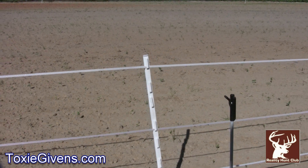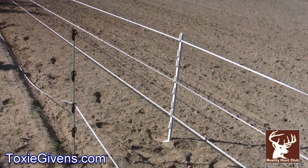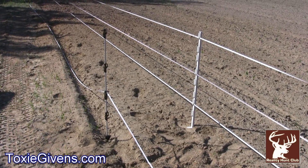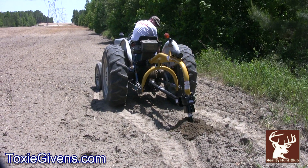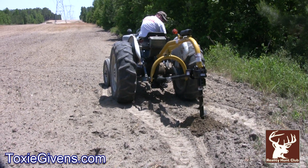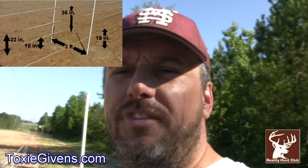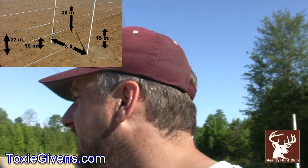The first thing we did is we figured out what we wanted, and we went and bought these small poles. We bought two types of small poles, because we couldn't get the exact height we were looking for. It seemed to be working out pretty good. So then we came out here, laid it out, marked it out, and then we got our auger that we bought last year and we drilled 38 holes for the big aluminum poles. We actually have a mixture of the big aluminum poles and the small poles. Once we dug our holes, we went in and got our tape measure and set the poles to the correct height. The outside one is 18 inches, the inside one is about 10, and the first string on the inside is 10. The second string is 22, and the third string is about 36.